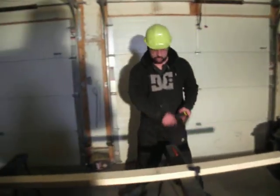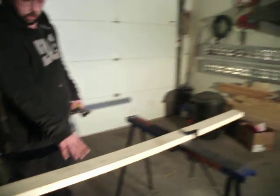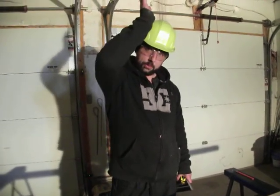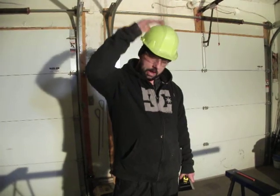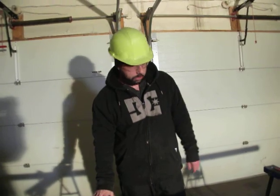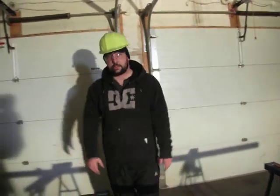That's the completed wall layout. You do that twice — once for the top, once for the bottom — and you can mark out all your studs. When you go to install the window, you just adjust your cripple jack to the height you want the window to be, and then your lintel and the upper cripples bring it down to the rough stud opening required for the height of your window, and you would frame that in no problem. Follow the steps and you'll have no issue building your wall. Thank you for watching.